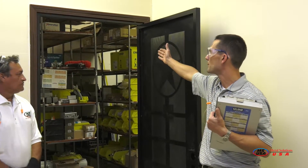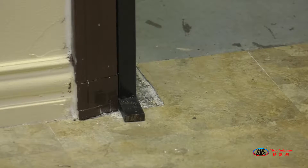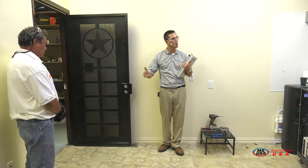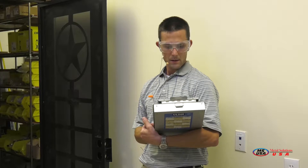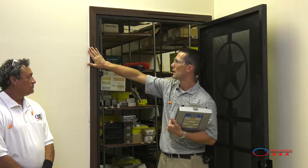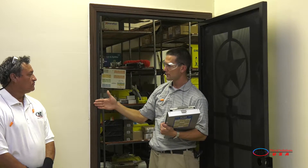As you can see, we've already completed step number one. At the bottom we've got our spacers down there holding our door frame up. We've got our wedge here on the lock side of your door. The purpose of the wedge is to keep your door lifted off the ground so that when you're complete, your door is actually going to open and close without hitting on your floor. You want to maintain an even space between your new security door and the existing door jamb. We've chosen to install ours about three quarters of an inch from the front of the trim, though you can adjust this based on your preference.